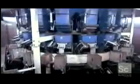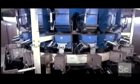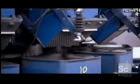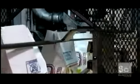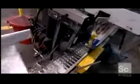A conveyor transports the briquettes to automated scales that weigh them for packaging. Every portion is the same, plus or minus 1 briquette. As the scales release the briquettes, robots below move bags into position to capture them. A sealing machine glue seals the bags, then prints a production date and shift code on each one.